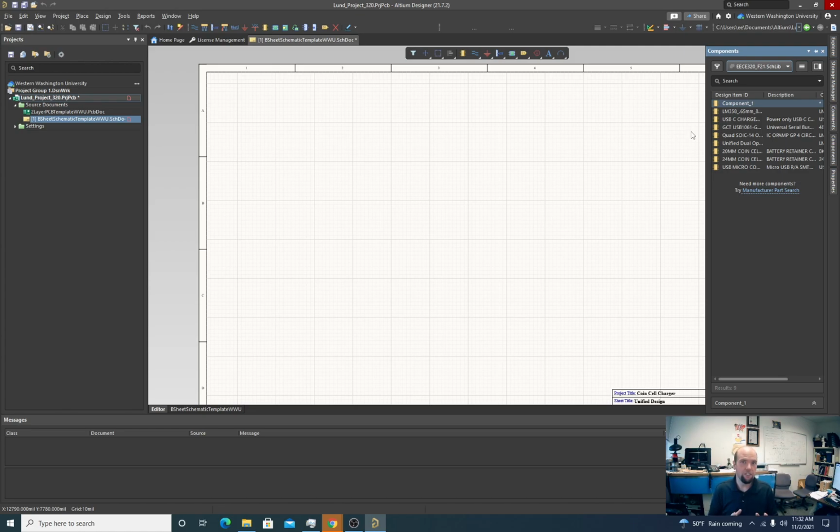That's a bad design choice in general. You're going to want to have one. If you have multiple USB connectors, the way my design will work, it will technically be capable of accepting any of the three. The problem is if for some reason somebody connected two at the same time, it could create an issue. So what I'm going to design is not going to be safe to produce as an actual consumer product. If you wanted to have multiple USB inputs that can power this thing, you'd have to have some sort of isolation between the inputs. So if you have two different inputs, rather than having them all connected to your 5-volt signal, you'd have to have some sort of diode or transistor that's keeping those signals from shoving current back into the other device.